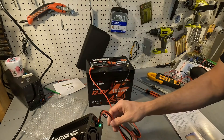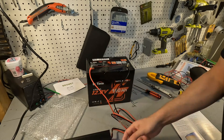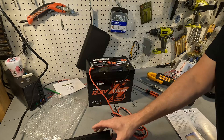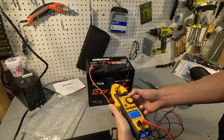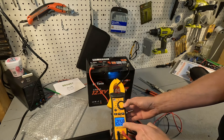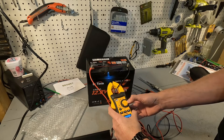Let's plug it in. And there we go — it's off and running. There's a fan right here that kicks on as soon as it starts charging. Let's check the amps to see what we're getting. We're getting 20.6 amps pushed into the battery, so it is a true 20 amp charger.